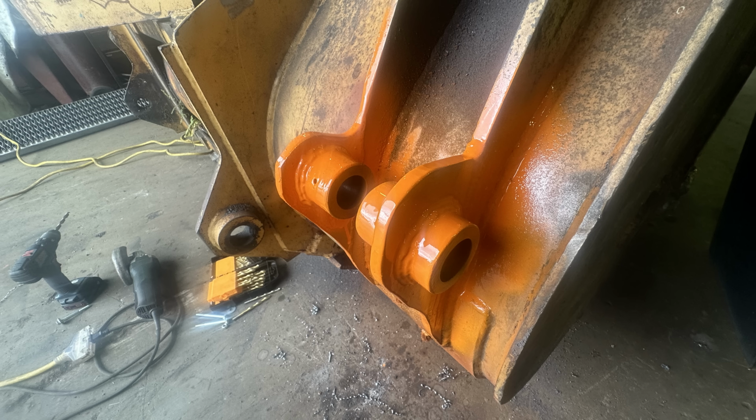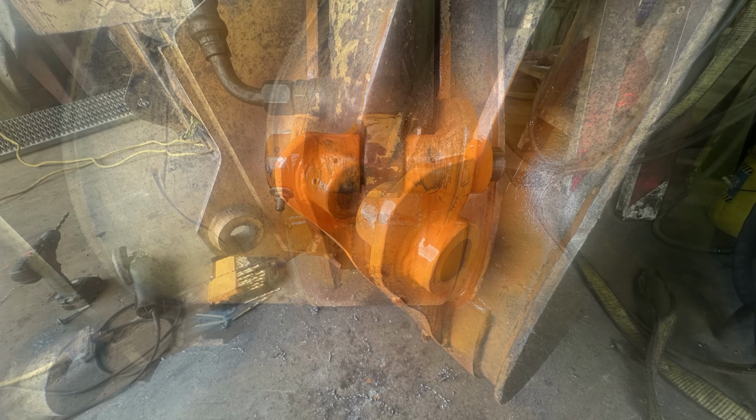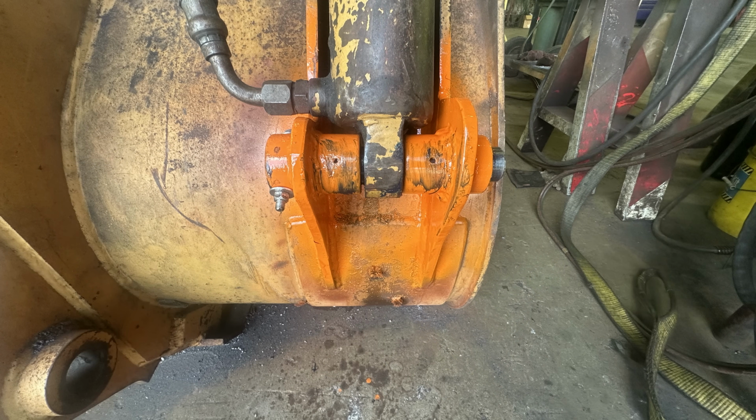And since the pin that I put in wasn't broke or fatigued, this shouldn't break off. I ended up drilling the left side for a retaining bolt and used a pin meant for a snow plow that was hardened and basically the correct size, around 1.5 inches. I ended up putting some grease zerks in those holes just to cover them.